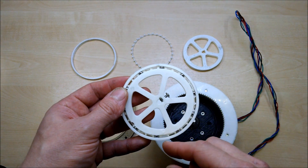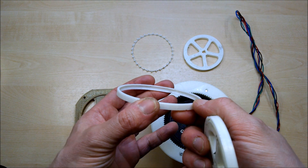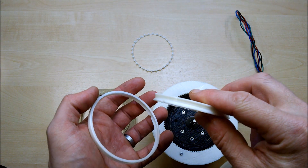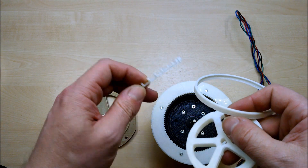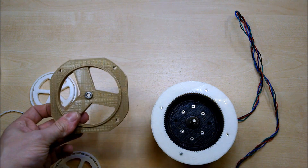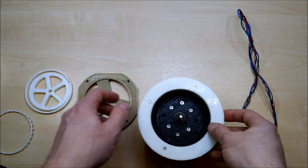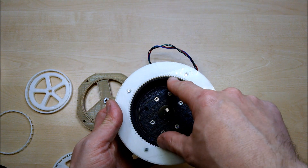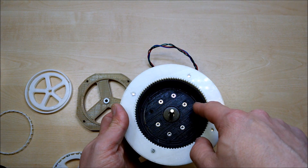I don't think the sparsity of bearings is the challenge. I think it's the surface finish of the print. It's made up from the elliptical wheel in the centre, obviously a recessed race there, a circular one on the outside, and the retainer for the bearings. I've taken the front plate off, which had a support bearing for the stepper motor shaft. This ring of outer teeth is meshed with the belt at a couple of points where the wave pushes it in, and it glides past on the sides.